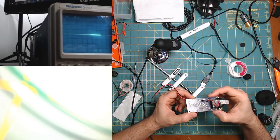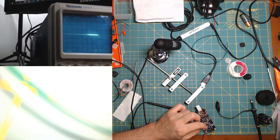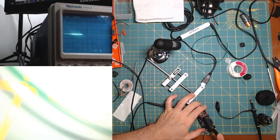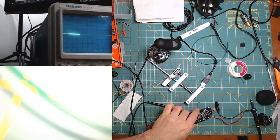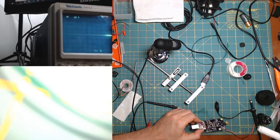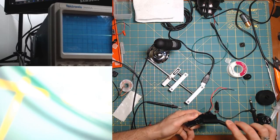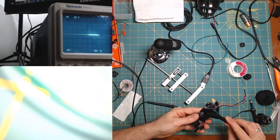Ah, look at that. No-clean fluxes are apparently conductive. Well, let's clean this no-clean flux properly this time. Yeah, because that's exactly what I have. No-clean flux. And it doesn't say anything, so maybe it is. How about this one? Liquid warning. Nope. Neither of my two flux pens say anything, so. All right.